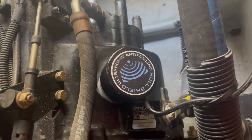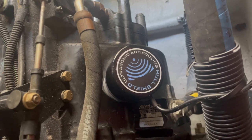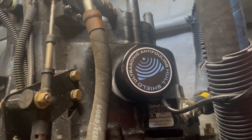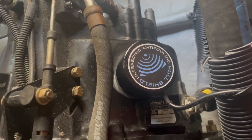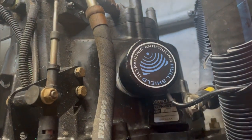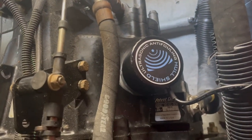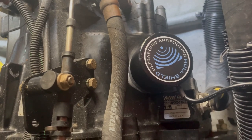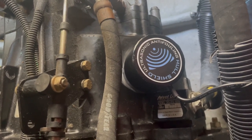Other than the lights flashing on the controller, you really don't know if it's working or not. That's our total install — it took about four or five hours. You've got to prep the surfaces, mount the transducers, run the wiring to the controller, and wire up the controller. Depending on your boat and how much room you have in the bilge, that'll make the difference. It's two days to install because you have to wait for the JB Weld to cure. It's going to get a lot of vibration from the motor running, so we'll see how it looks when we take it out of the water next year. Stay tuned for that episode — thanks for watching.